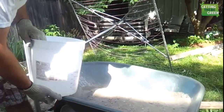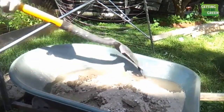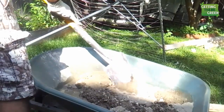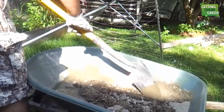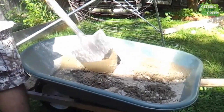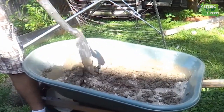I am going to add the water and then mix it up. If you have a cement mixer, this may be the time to use it. If not, just use a wheelbarrow like we are. It is easiest to go one bag at a time, even if you are doing multiple bags. Follow the instructions on your bag — for a 66 pound bag it was 2.6 quarts of water, or 2.5 liters. Make sure you read all of the instructions on your bag of Quikrete because it does vary from bag to bag.